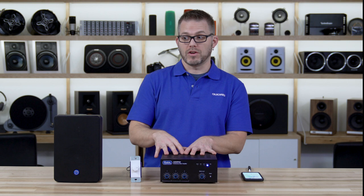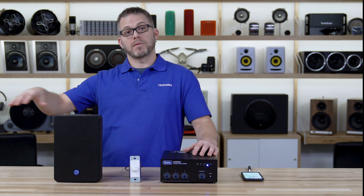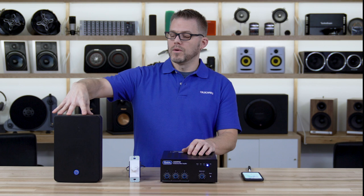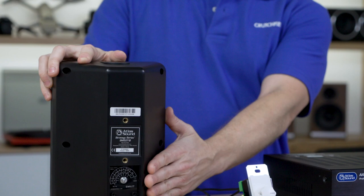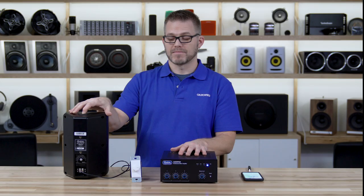It's very important to think of the system as working as one big unit, with volume being reduced most at the speaker and the local volume control, where the amplifier is just providing a reservoir of power. If you're in a space with multiple speakers spread across a big room — say the bar is on one side and the dining area is on the other — we recommend balancing the room by reducing the tap setting on the speakers where you need it quieter, rather than increasing tap settings to try to get more power out of the system.